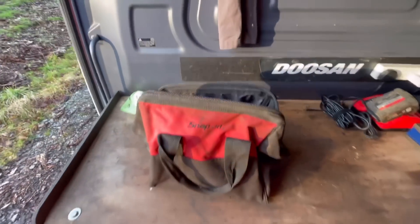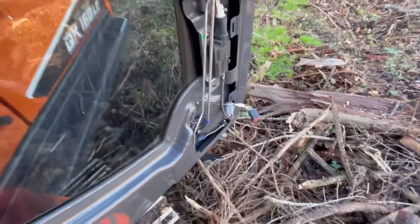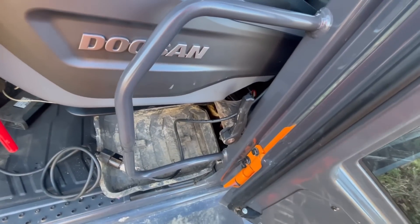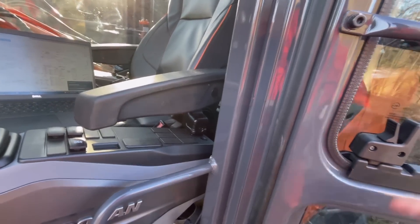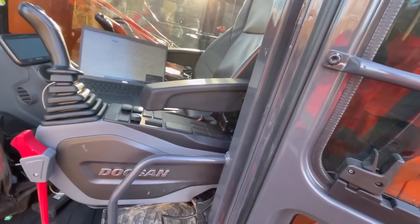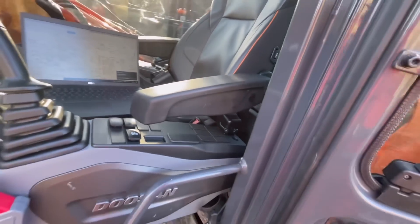Bag full of tools — I've had some lunch and I'll head back. There's absolutely nothing happening at this plug whatsoever, so maybe that slip ring is broken. I'm going to pull the back of the cab out now, find the smart key controller, do a continuity test between there and the controller, and pin the back of the controller plug to see if it's outputting.